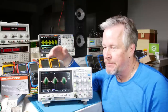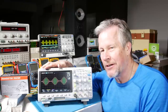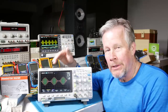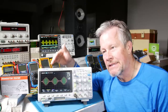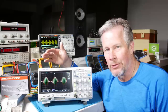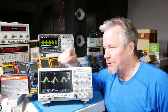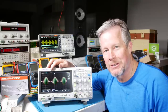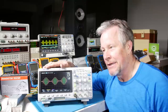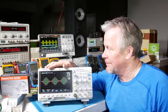Back in the day, because scopes were expensive and tubes were expensive, they offered scopes from 5 MHz on up to gigahertz range. Nowadays you can go to 5 GHz. With digital scopes I think they start at 50 MHz — I don't think you can get anything slower than 50. So 50 MHz is a respectable bandwidth. I've got 200 MHz scopes here just for the coolness effect, but if you want to save money for other things, I think 50 MHz is probably good for most people.